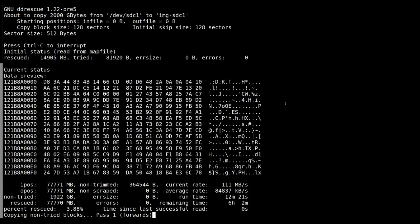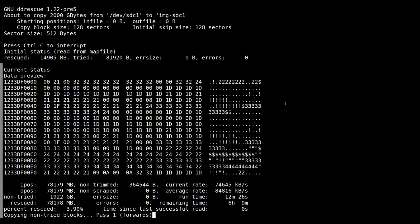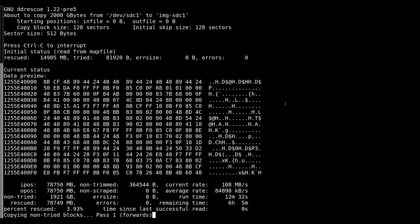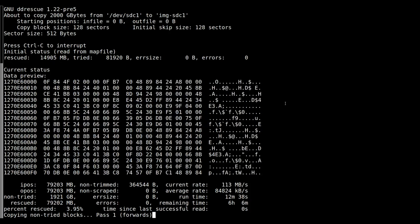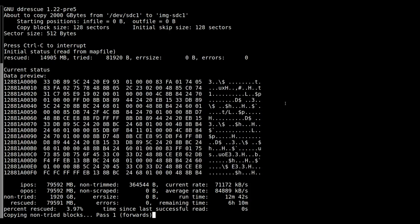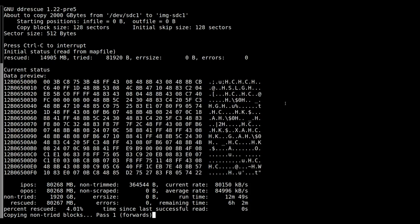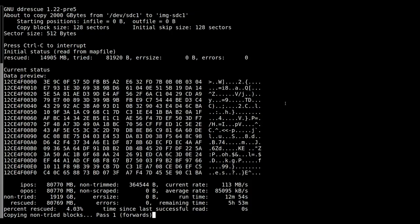If I was pushed, probably the other alternative I could take was to get a second hand drive of the same type and then use it as a donor for this one. Still, like I said, we got lucky. That's really good. The data's going to come off this hopefully just fine. Once it's all read and it's picked out as many of the bad sectors as it can, I'll be able to then just mount that image, copy the data I can off to a new drive for the client, and everyone should be happy. I should get my money and they should get their data.